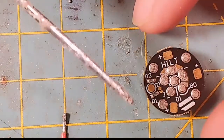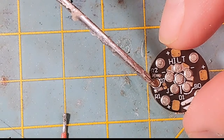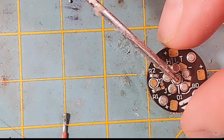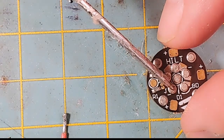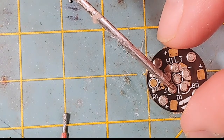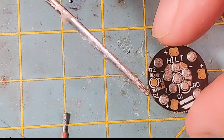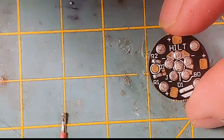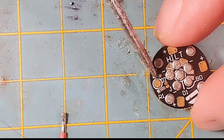But at any rate, we removed this resistor because I wired it in V4. And then my second data line for the Shtok pixels, which is the brown wire, was attached here. My main data wire, which was purple, was attached to the center pin, and then I had one single 22 gauge black coming off this negative pin and one single 22 gauge red coming off this pin. So I had four wires, 1, 2, 3, 4 wires coming off of this connector, and I don't need the resistor you saw in the diagram because it's already on board the connector.